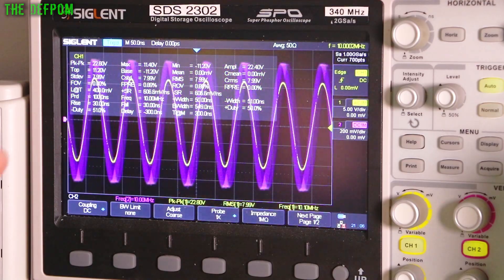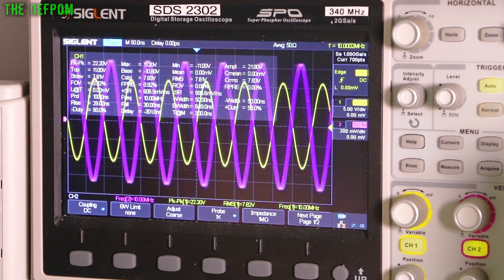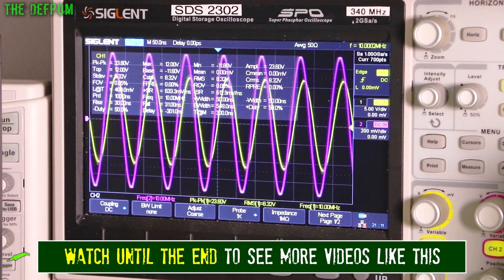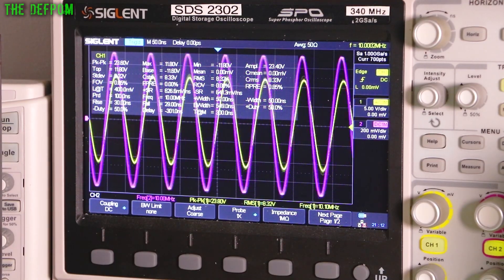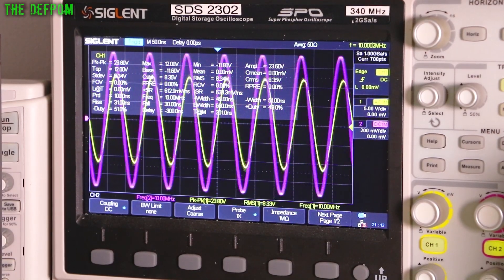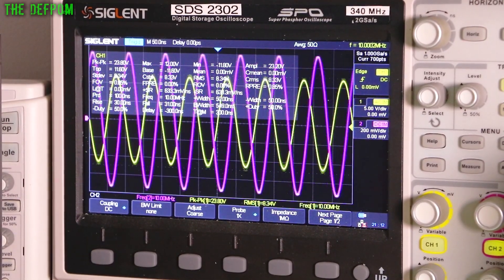It's just about locking - see it's getting there. That is the rubidium saying it's almost there. There is a difference. I'm going to move the GPS antenna. Everything's been on for about five minutes now and the rate is getting slower - they're getting closer as it all warms up and settles down. I've put the GPS antenna outside the window. The alarm light is still on the GPS DO - that may mean it still doesn't have satellite lock, doesn't have enough satellites, or hasn't had time to get a decent lock.